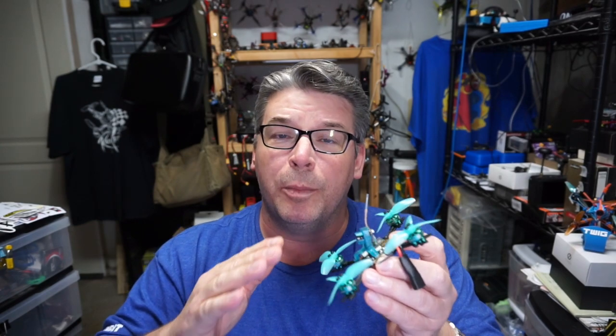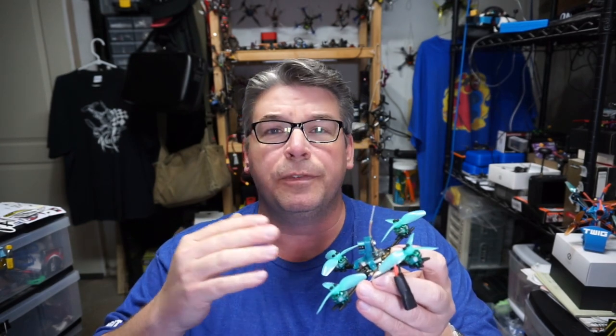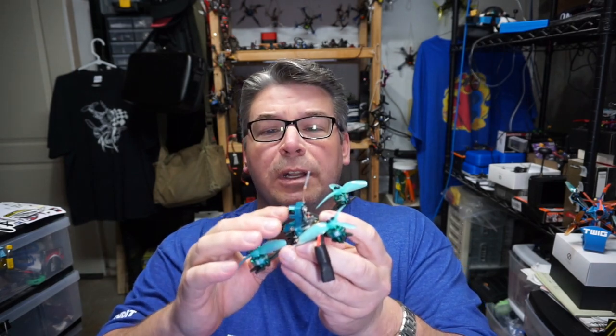This isn't a blow-by-blow build video — it's kind of a general premise. I do a few things off camera, namely all the little soldering. We do a little bit of soldering on camera, and I use an all-in-one camera and VTX, but I also show a build that's got a separate camera and VTX. Your solder pads may be in slightly different locations depending on which board or components you choose, but the general gist should make sense. We also walk through BLHeli and do the Betaflight setup as well.